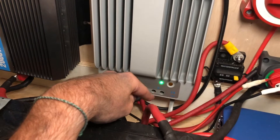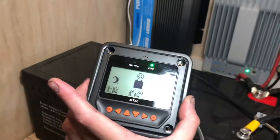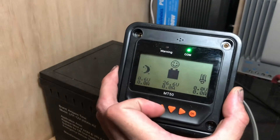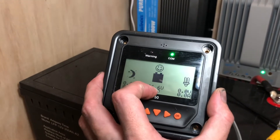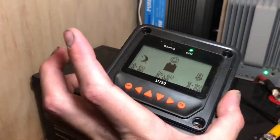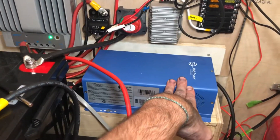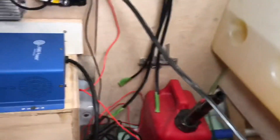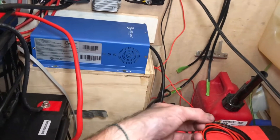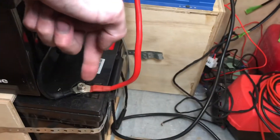There's a little option on the charge controller for connecting lights or other loads, and this is basically my communication to my batteries. Right now you can see 0.6 volts coming in because it's nighttime — no solar. But during the day I get about 35 volts coming in, and that keeps my batteries, which are at 26.6 volts, happy. There are other settings you can program to your liking. This is my other option for charging my batteries — a charger that connects to a 110 outlet. I'll probably drill a hole through the floor to run an extension cord so I don't have any holes going to the outside of the van. It connects directly to my batteries.